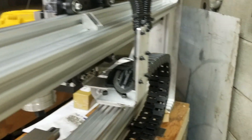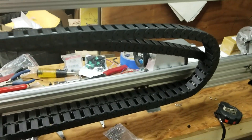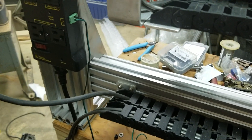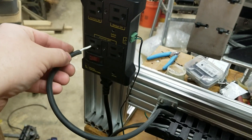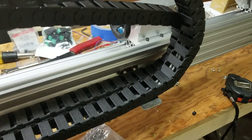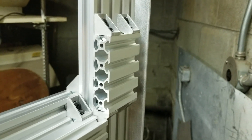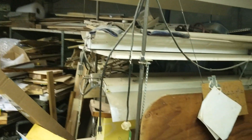This thing glides super smooth, it's real nice. I got two drag chains — one has the motor cables in it, and the other one has the AC for the router, which will get this plug here and plug into the relay like this. I like keeping the AC separate from the DC. And then here's the blocks where the belt and links will go for the X-axis — it's the only one that's going to have a belt.